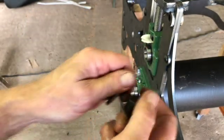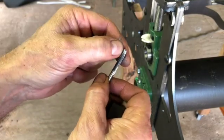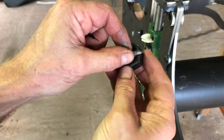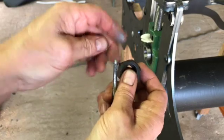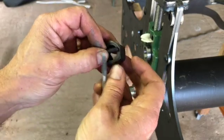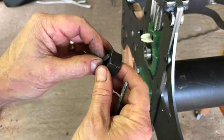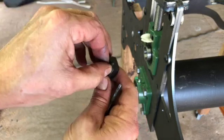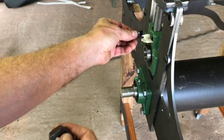If you look at the end of the tap, it is tapered. So I stopped short of the end, just almost there, so that I can actually turn this in tightly. Because if the hole was tapped all the way through, it would be a problem — it can turn further and go out on the other side of the nut.